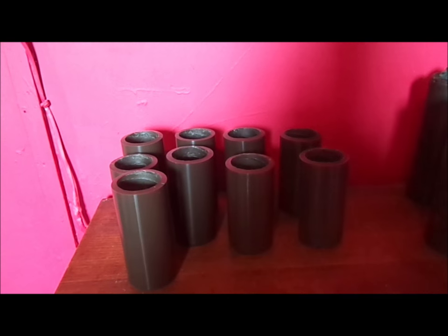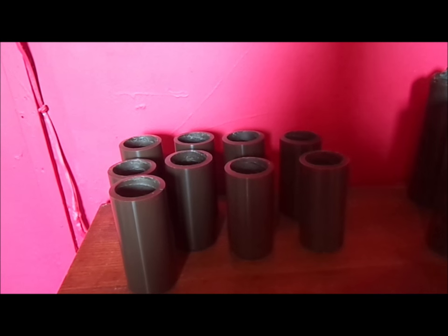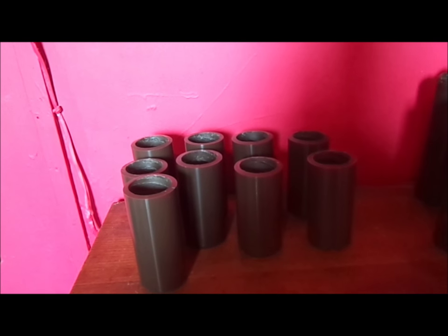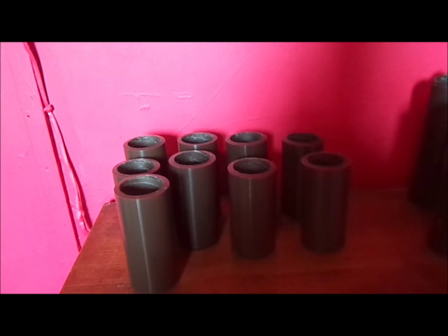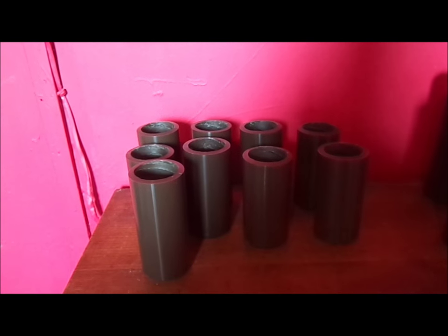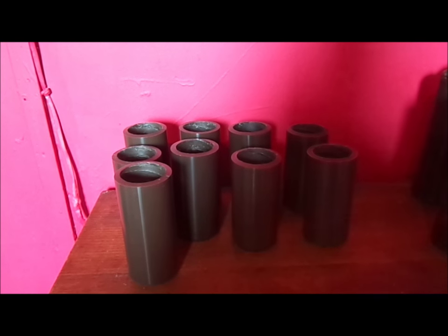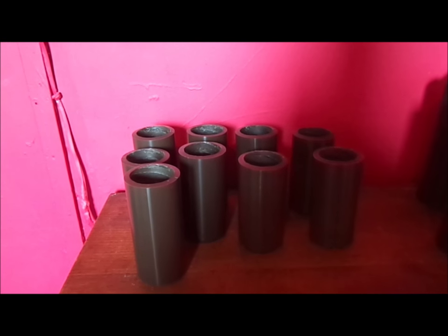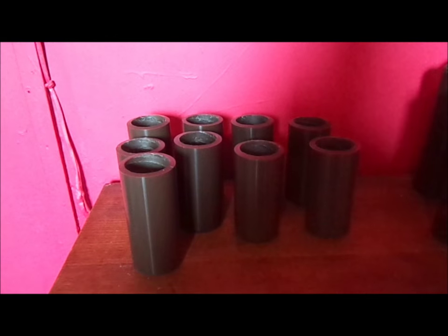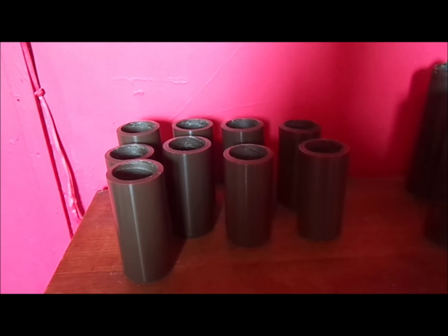You can heat it up in an oven, and some molds need to be heated up to almost 500 degrees, so around 450, some molds. Some of them need to be just warmed. They need to be at least 100 degrees or over to have a successful casting come out of your blank. Sometimes you can pour wax in it a few times and make a blank out of it, and that is your preheat. The first couple cylinders are discarded, and then after that, you keep a pattern up, and you will make successful blanks. Any break in the pattern might disrupt how the blanks turn out.